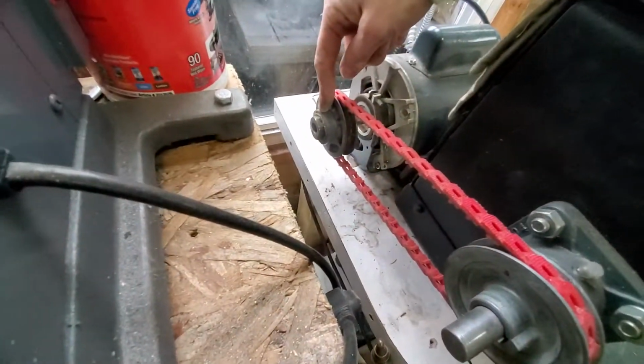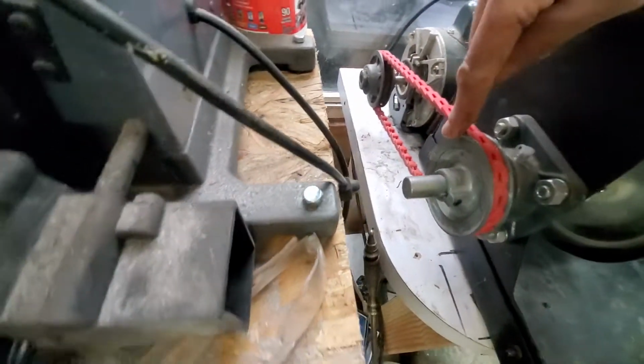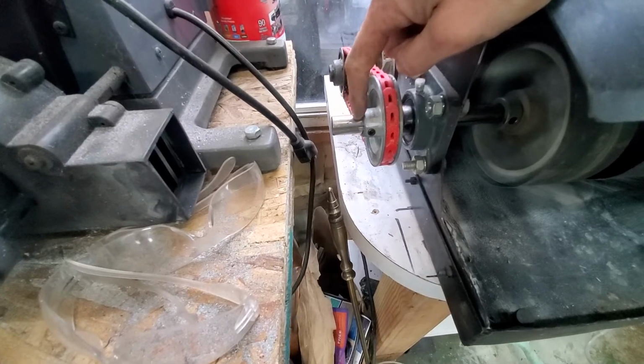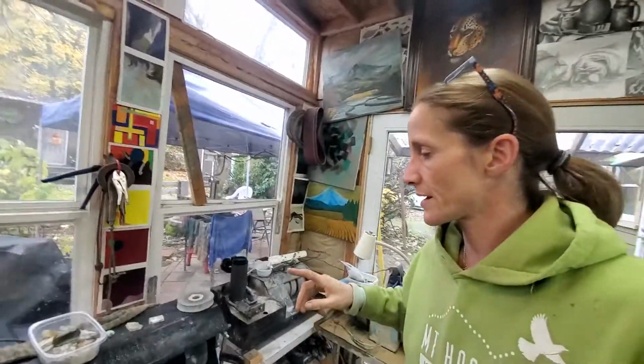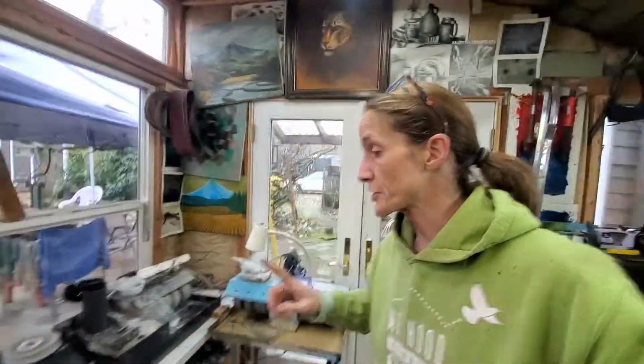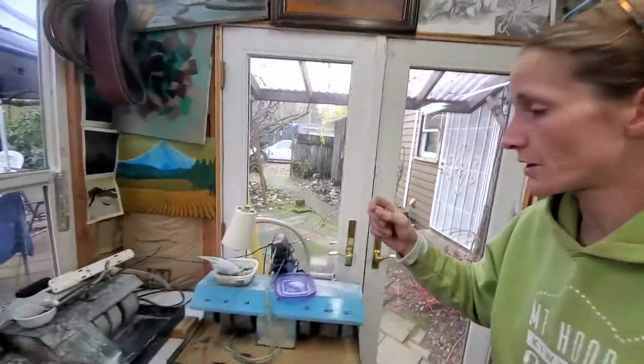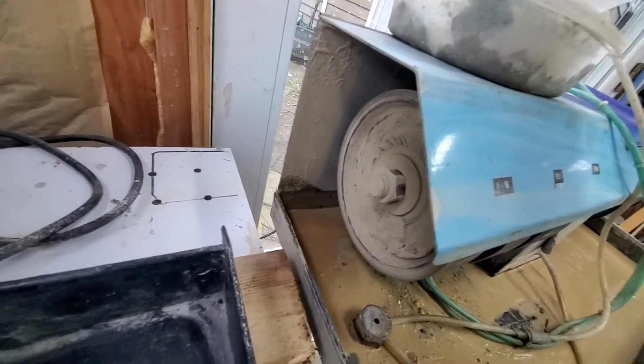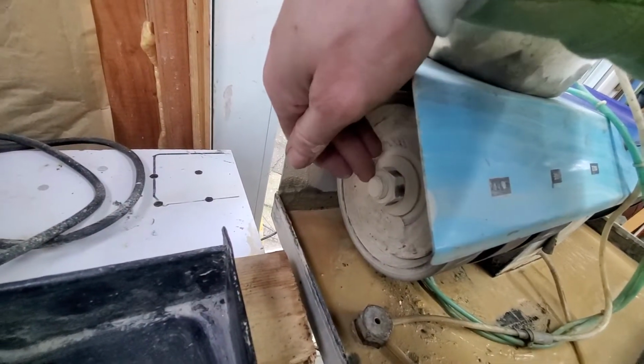I found the pulley online. This pulley is then brought to a shaft. I only paid about $28 for the shaft. So there's several different ways of building your machine. You can buy a shaft with screw-on ends that's threaded, so you can get a nut around it. So you see this shaft here, it's got a threaded area, and then this mounts in.